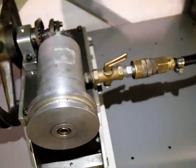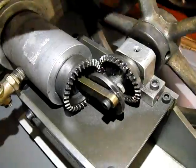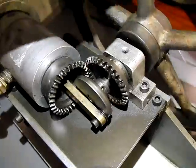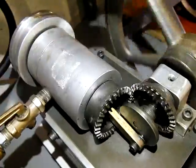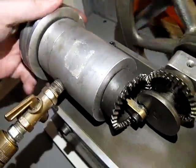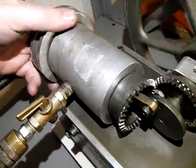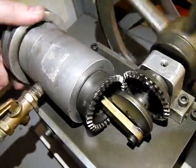The way it works: the sleeve of the piston is rotating itself by the end effect of the connecting rod, as you can see there, through the bevel gears. Not only is the sleeve connected to the output of the pulley here, but it also acts as a rotary valve that allows air pressure into itself and exhausts right out the side here — directly into the air cylinder.